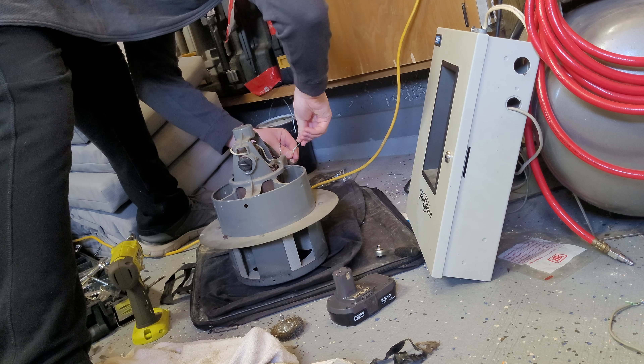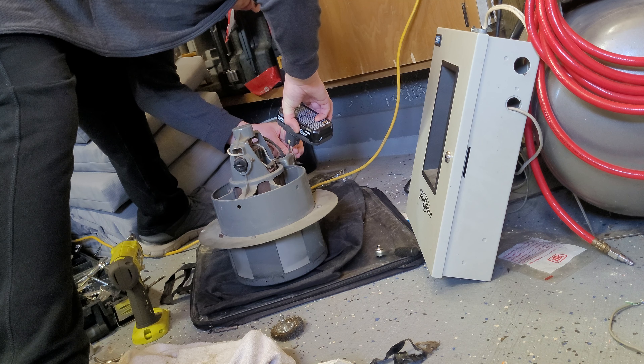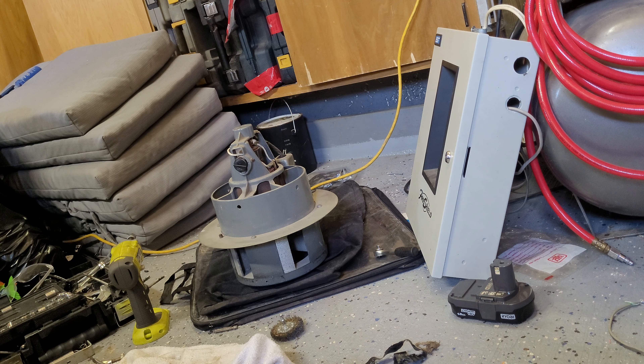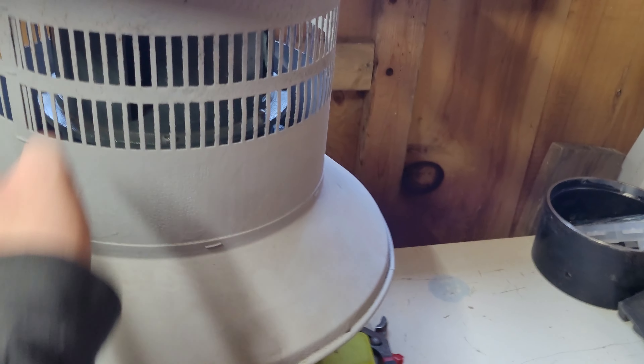It's kind of tricky when the wires are huge and stripping a bit. It works fine. That's the junction box of those 14-gauge wires. Now that I know what wire size they used for this, I could have used 14 instead of trying to fit 12-gauge wire onto the old stator for the Federal Enterprises Model 2 that I tried to fix. Now that I know, I could have used that at that time, but you'll learn from this kind of stuff.